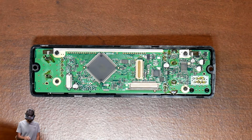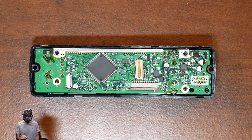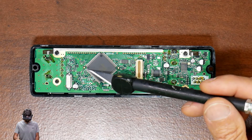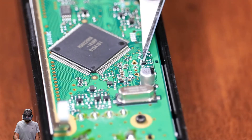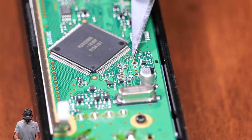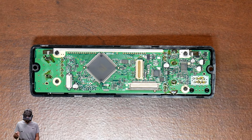Before I begin, I'm going to give you an overall view here of everything, give you an idea of where everything is at. This chip here is IC1 — that's going to be a reference point. This is the bottom of the display panel, and here's the mic jack over here. This is pin 1 right here with this dot. You're going to want to come down on this side of IC1, and D13 is your Huckleberry — it's right here. By the way, if this is a European version and you have this diode right here, this is D11 — pull that one out and you'll expand the receive, but this is already done as you can see.